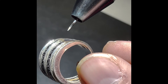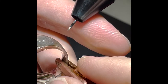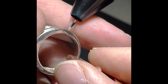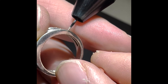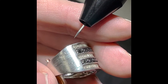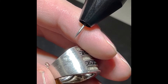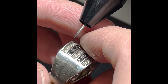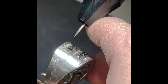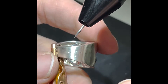I'm going to turn down my energy — let's go back down to 10. It's a good idea to get rid of excess soot so it doesn't get mixed into the weld. Let me go polish again and get a better look. This is looking much better. Obviously there are still a small few holes I need to fill in, but I can do that quick and easy. We started off with great big gouges in this ring; these remaining ones will be very quick to fill. I'm going to turn down my energy just a little bit — I've been at 10, let's go down to 8. It's okay to do a little trial and error on finding settings; you just have to find something that works best for what you're working on.